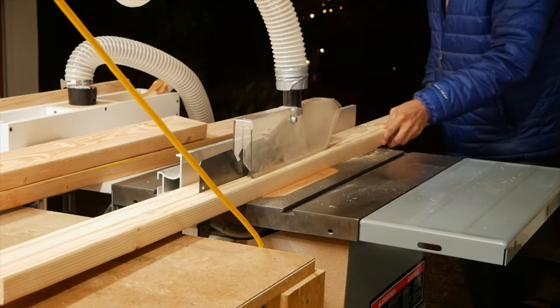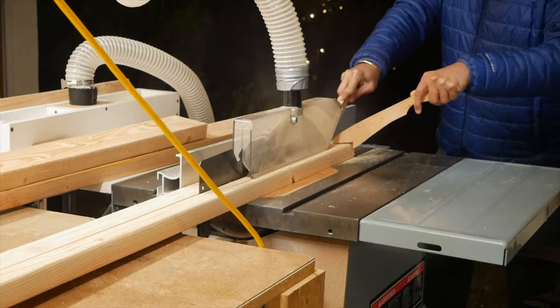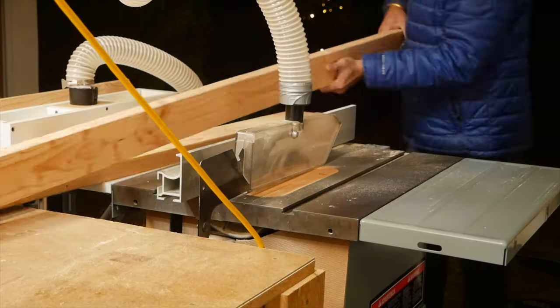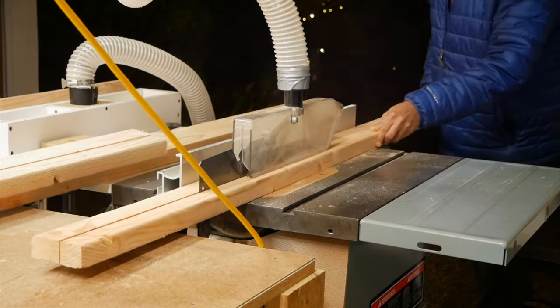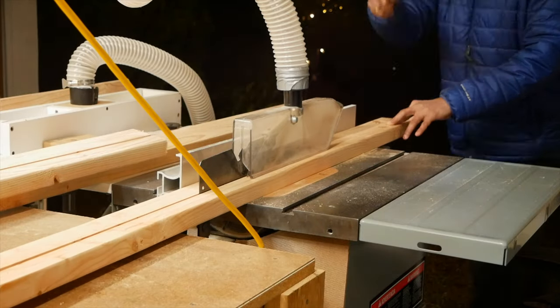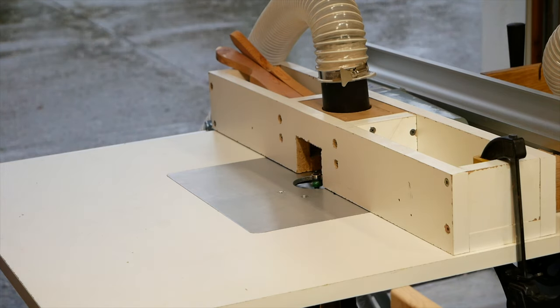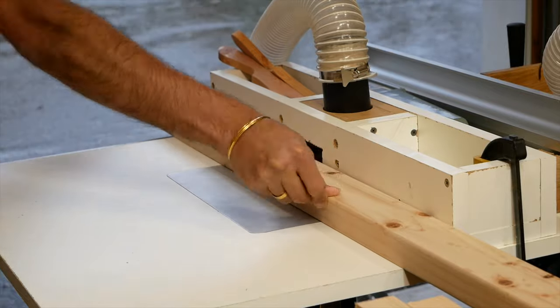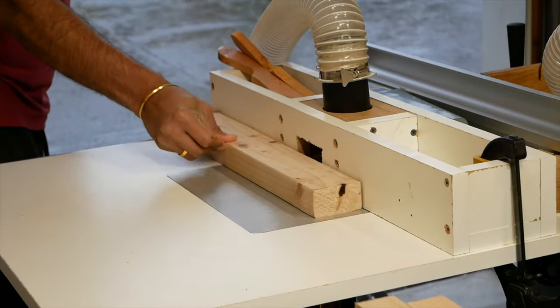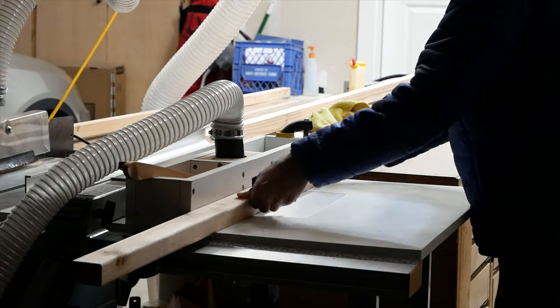While working on the screen, we started to realize it was going to end up quite heavy—heavier than we anticipated. So we decided to rip the vertical pieces down to reduce some of the weight. Our horizontal pieces were basically just really long 2x3s and our vertical pieces were slightly wider 2x2s. We then routed the edges of our boards, putting a light 1/8-inch roundover on the outside corners and a heavier 1/4-inch roundover on the inside ones, to try to prevent any potential lines from showing up on the projector cloth later in the project.